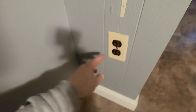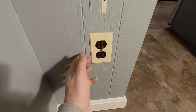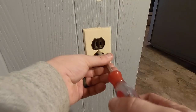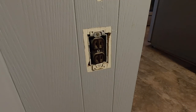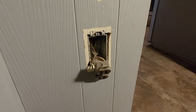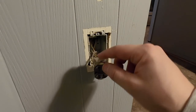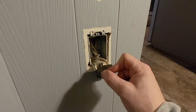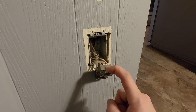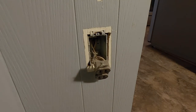I'm pretty sure this is our culprit. I've made sure that it does not have power, and I'm going to take it apart and see what's going on. It looks like it's just those two wires, which means I'm going to lose this outlet, but I'm going to be able to potentially eliminate the junction box in the attic. And that, to me, is more important, because I can add an outlet later on down the road.